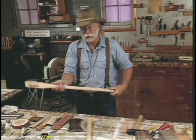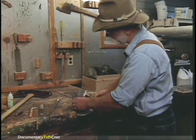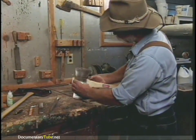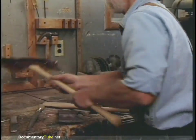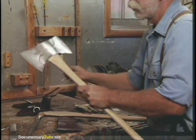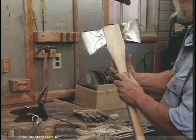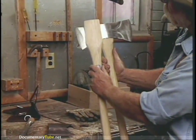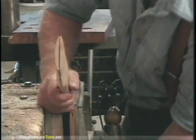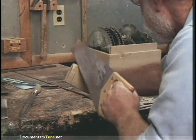That's where the expression got started. Before we hang it, I want to show you exactly where it should go. The axe head should always be right down. You can see this swell right here on the shoulder of the handle. When it's finished and properly hung, it should look like that, as opposed to if it was only put into the end. Notice how far down the shoulder would be. So we're going to cut that much of the top off, mark it, then cut that off.